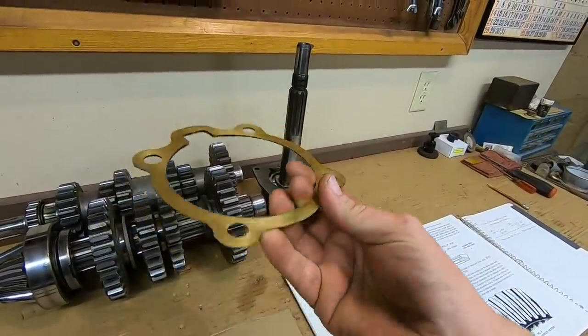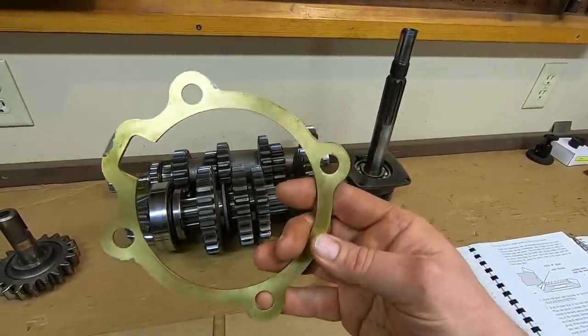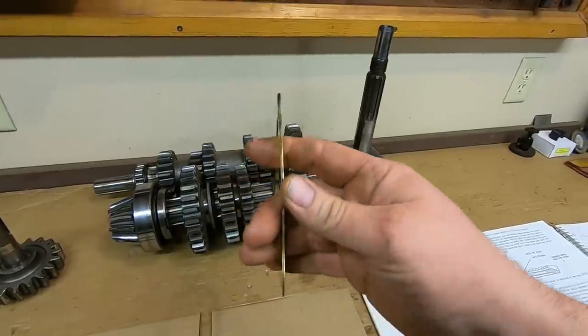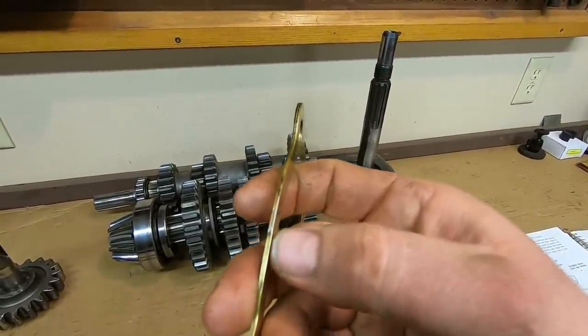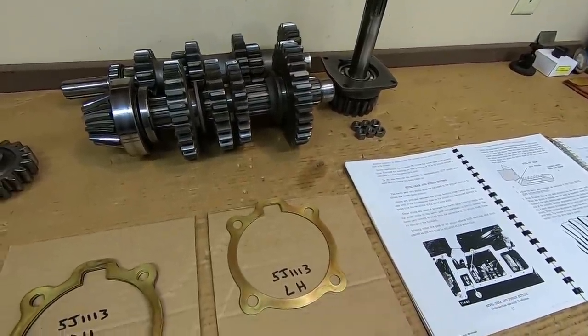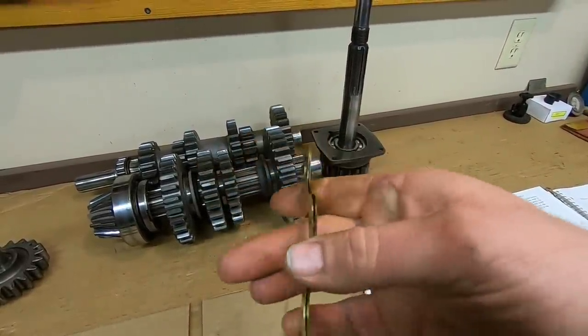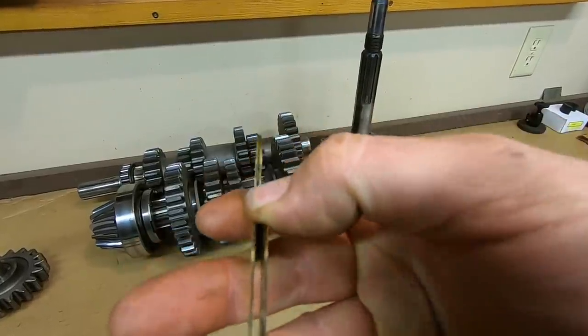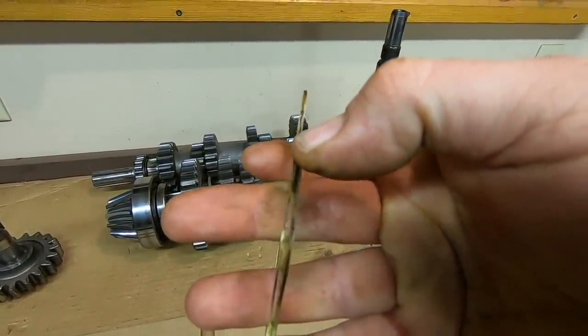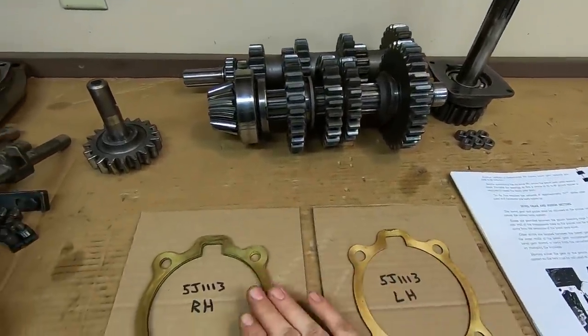This is the left hand pack and honestly these are pretty good - they're not crinkled up, they don't have any bent corners. Usually if these D2s have had people into them numerous times, these look a lot worse than what we have here. You can even see they put a little dab of solder on these to keep those shim packs together, and every time they have to peel one off they just pull a pocket knife in there and slice it off. There's the thicker 30 thousandths and then a series of the fives. I think I'm going to start with these shim packs and just see where that puts us preload-wise on those bearings.